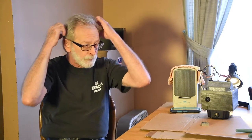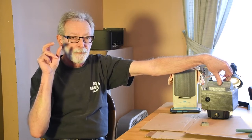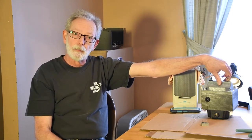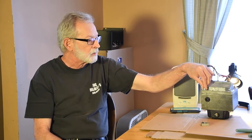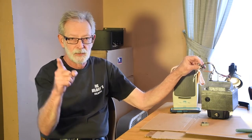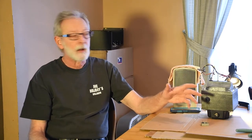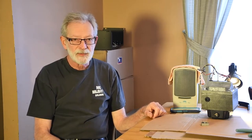From the rectifier we are also going to do infrastructure wiring — from the AC input to the fuse, leaving a place for the front panel. This is a big project. Another thing you're going to have to be aware of is insulating your mounting bolts. I've snipped a whole bunch of wires off this thing and I know what has to be hooked up, but I'm doing this for people who are beginners and not really familiar with doing all this stuff.